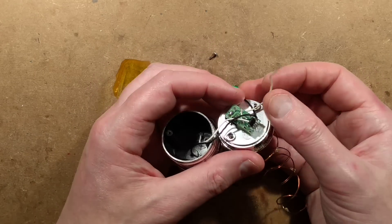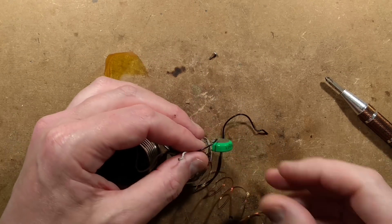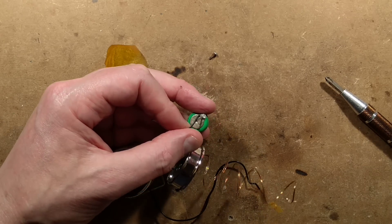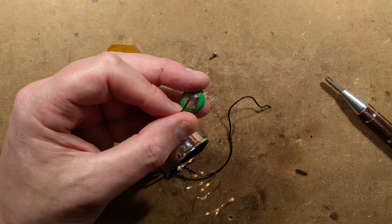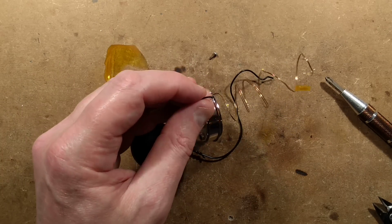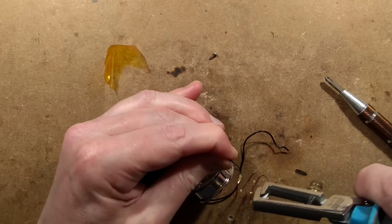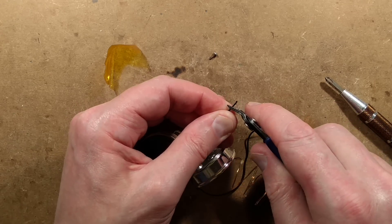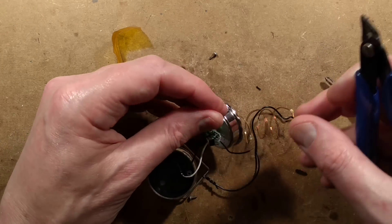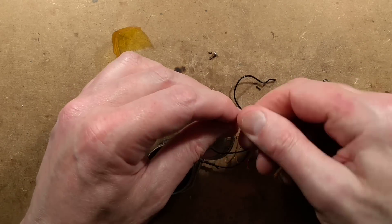The inside looks dry and clean - the circuitry looks immaculate, very clean. So let's change that battery; that's a good start. We'll see if it kicks it back into life. I'd also like to find out what the short circuit current of that cell is - I can do that by measuring with a meter across the battery charging contacts. You can buy these nickel metal hydride button cells in bulk on eBay. It looks like it's corroded at the end - it looks as though it could have been a chemical from the battery.